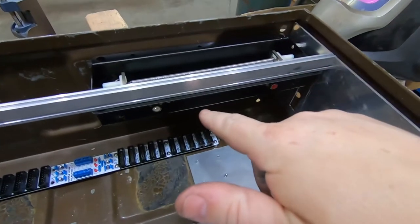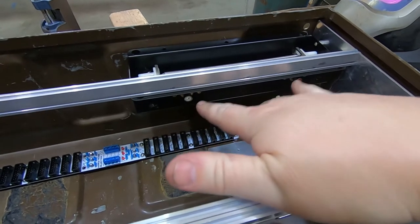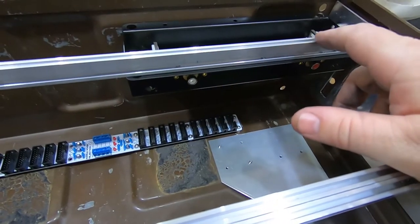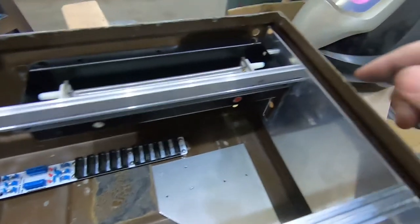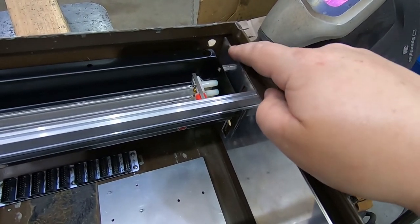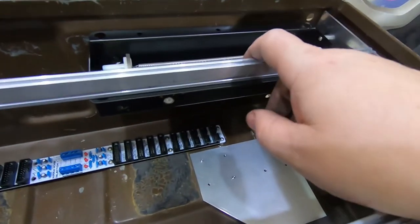I ended up doing something a bit different than what I was planning because I realized keeping access to these RCA ports was going to be hard that way. So instead I milled off the bottom of this rail flat and drilled and tapped some holes in it. So the tank is screwed into place in those 3 places and then screwed to the side plate through this standoff like I was originally thinking. I think it came out pretty good.